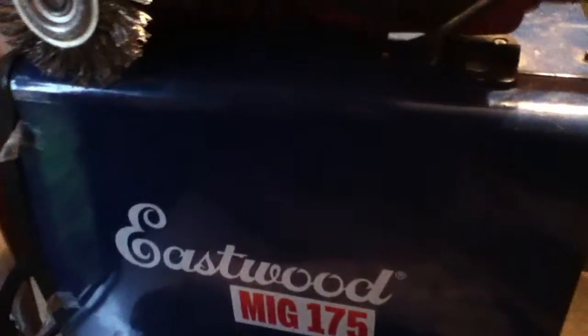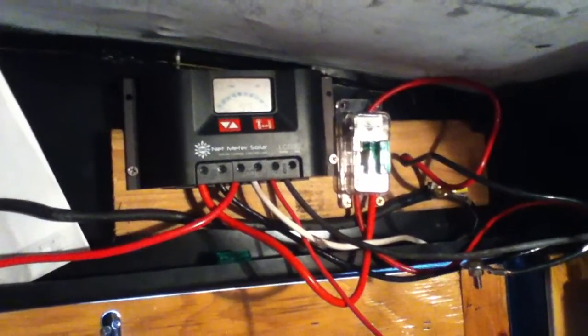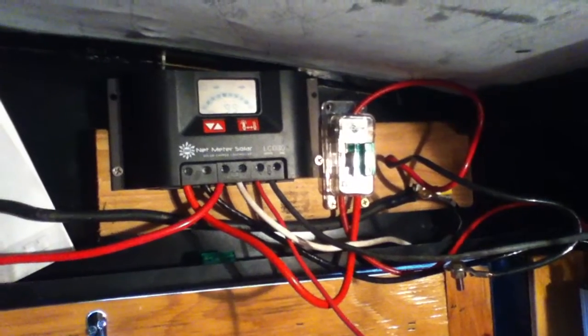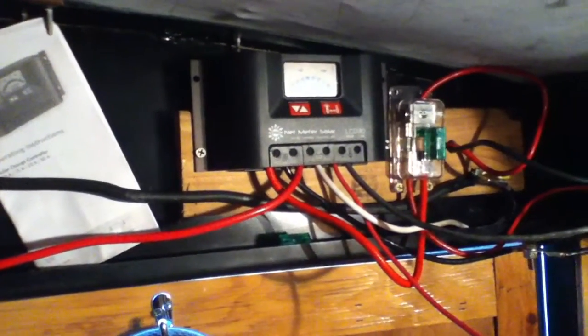Everything here is capable of running on solar except the welder, which needs 220. I actually have a little welding station that works as long as I plug it into 220 outside. Regular woodworking kind of works in a very cramped space with cordless tools, so that's a success. This is a combination off-grid and grid tie arrangement — it could probably handle a 500-watt grid tie inverter even though it's only a 300-watt one. The idea is that when parked in the summertime and not in use, the battery bank charges up quickly and then saves a little off the electric bill wherever it's parked.